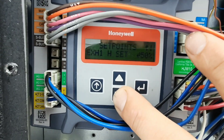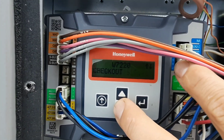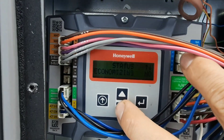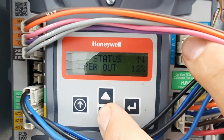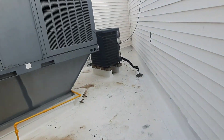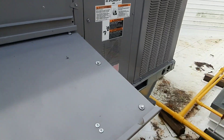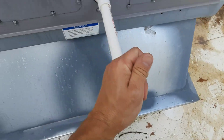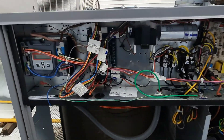So we're at min position — high and low. I'm going to go through this whole setup. It was just a min position problem and we're out at 12%. There she goes — she was moving, she just wasn't quite there yet. It won't actually start moving till it gets there. Well, that ought to help the cooling — that's why it wasn't cooling yesterday. Temp and humidity was way up, I'm sure. The trap's clear — pretty easy call. Let me see if I come up with anything else, try to get some more information. We might have solved our problem just like that.